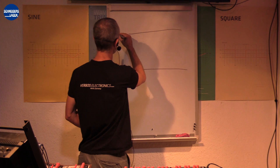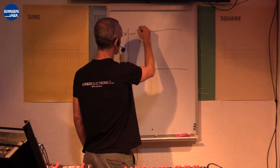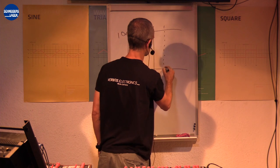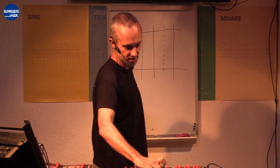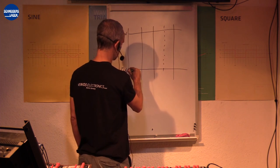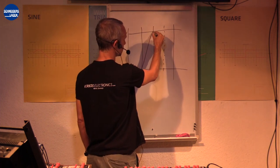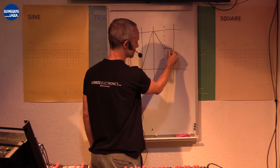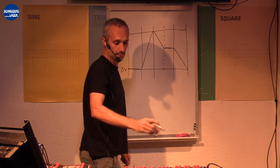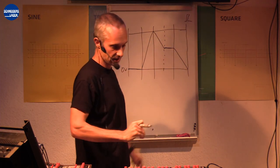Everything is going between ground, or 0 volts, and 10 volts. And we have these zones. So in the top section, the top one is delay, attack, decay, sustain, release. That one is going to look like a line down at ground for the first stage, a rise up to 10 volts for the next stage, a decay down to whatever the sustain level is set to, anywhere in between, during the next stage, and a fall during the last stage. And then at the top, there's an end pulse, which is going to send out a quick couple-of-millisecond spike at the end of the whole thing.